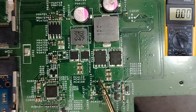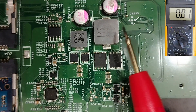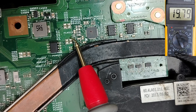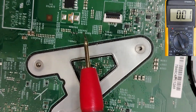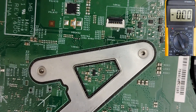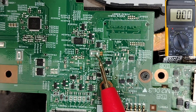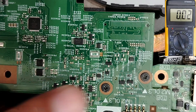The B+ is present here because the current sensor resistor is good. We also have 5V on this big inductor, 3.3V, and the same for the charge circuit — we have 19V because the current sensor resistor is good. For the CPU circuit we also have 19V on all input components. Don't neglect to check for dry joints on the power jack and the current sensor resistor, as this small component is the bridge between the input and all circuits.